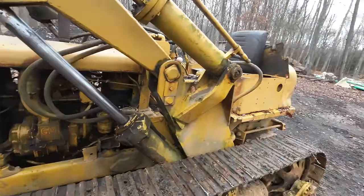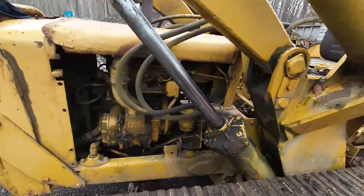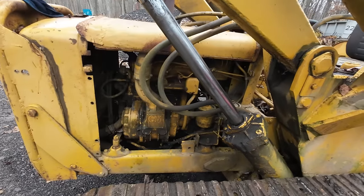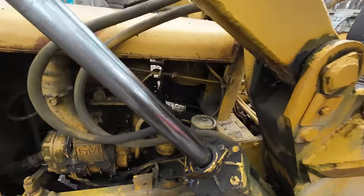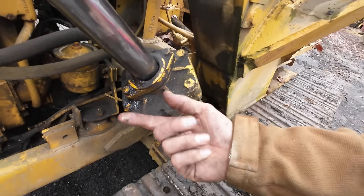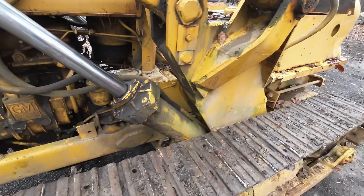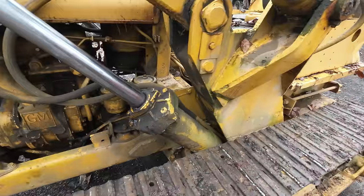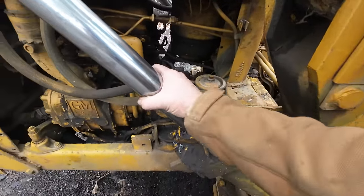All in all, I think it's pretty much exactly what you would expect for a $500 machine. We've got an engine that, well, it runs, but it's got some issues we still need to address. Obviously, some leaks. Our hydraulics function, but you can see they're puking oil out of the seals. And, you know, you could throw seals in there pretty easy. These ones are easy to rebuild, but the trouble is, you'd be wasting your time because the chrome is gone